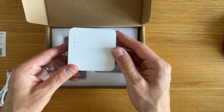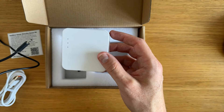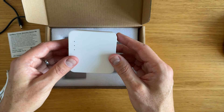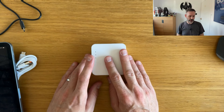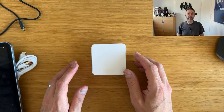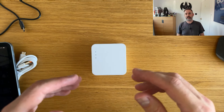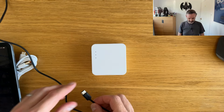I have a USB-C cable plugged into my PC, so why don't we just power this up and see what we do next. To get started, the first thing we need to do is power the unit up, and then according to the documentation it will create its own Wi-Fi network. We'll then configure the device to connect to my own Wi-Fi network, after which it should present itself as an ESPHome device in Home Assistant.